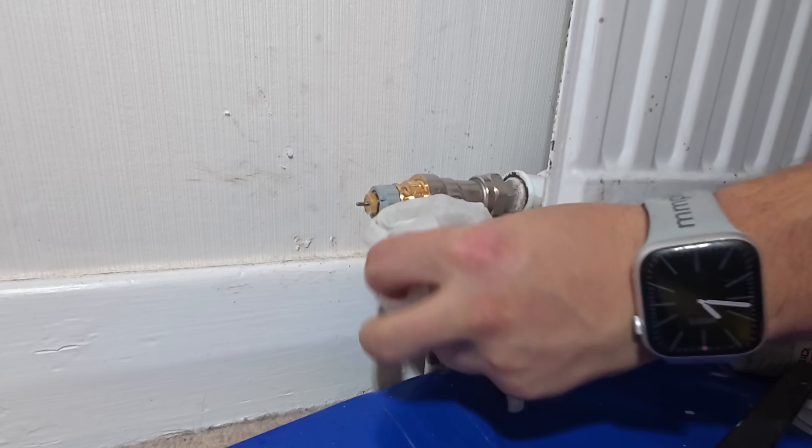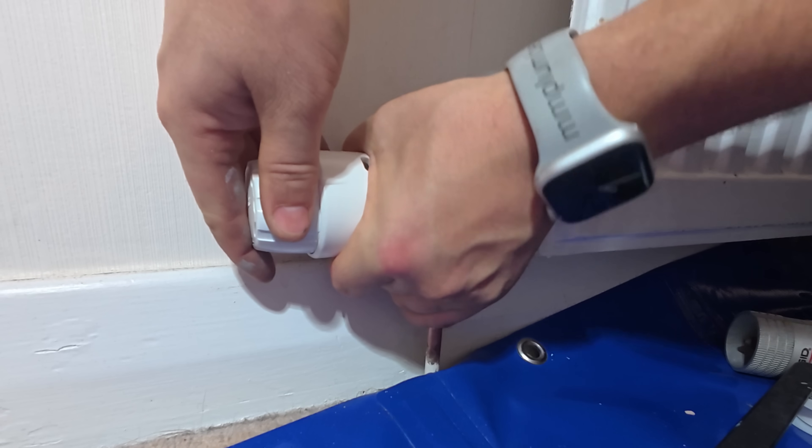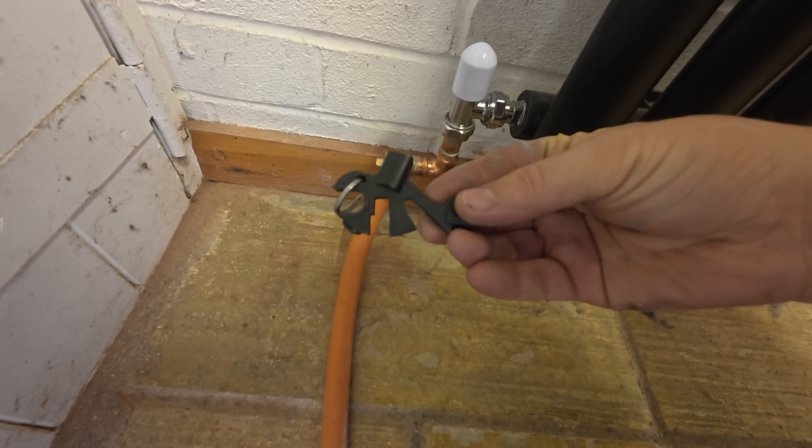Just give the fittings a good wipe over to get rid of all that jointing compound, and now we can fit our valve over the top — perfect. So the radiator valve is all done. What we want to do now is close off all the air vents, shut off the drain point, and then go ahead and fill the system. I'm just going to shut off the drain point I opened and use the air vent key to close it — look at that Plumb Shok, I'll put a link in the description.